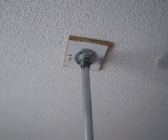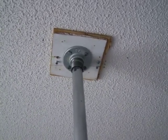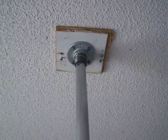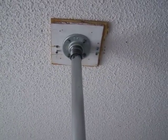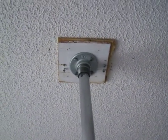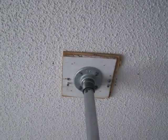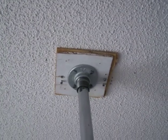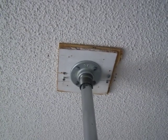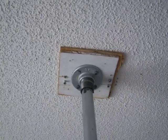Let's start at the top. I bought some plywood from the scrap area of their wood department and cut it up into four squares, about 6 inches by 7 inches. The only reason I have plywood up top is because my ceiling sucks and the flange would have put a hole straight through it. You want to bolt — whichever you use, the plywood or the flange — directly into the beam in your ceiling. Into the plywood, I've bolted a 1½ inch flange, and inside of the flange I screwed in a metal hollow nipple to insert the pole into. I put some grease on the outside of the pole and inside of the nipple, which helps it spin.